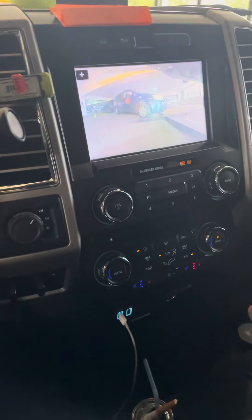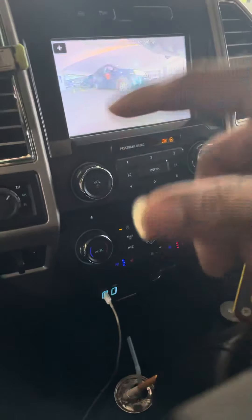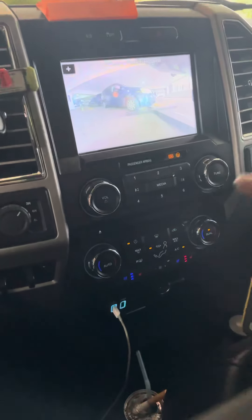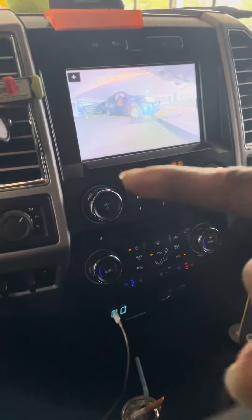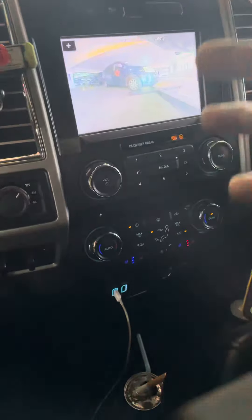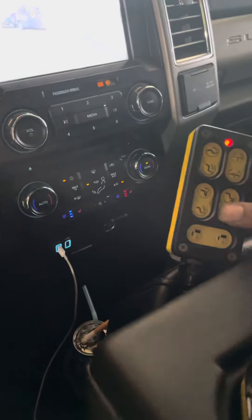So it's on the ground right now. But the trick is when you're doing something sideways — I always hear how you get it out of a parking spot, how do you get it from the front when it's sideways? It's a perfect lesson right here. When you put the boom down, get ready to back up to the car. The car is sideways and my truck is straight. Put the boom down like you're getting any other car — like the car was regular straight. But on the boom, you want to push the boom out.